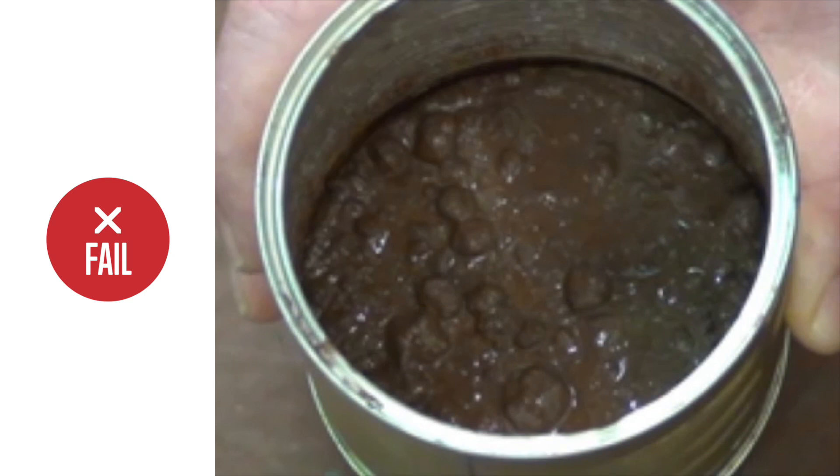After carrying out the CAN test on a sample that has had more water added to it, we can see that it is a clear fail. There is free water at the surface and the material has completely flattened down. It may also move in the CAN from side to side — it looks like a liquid, it flows like a liquid, it has liquefied.